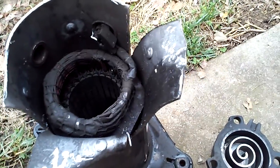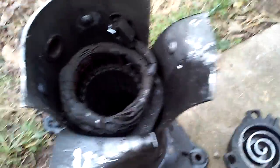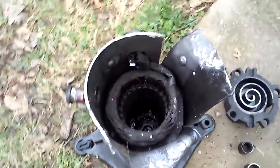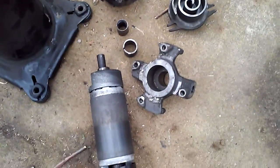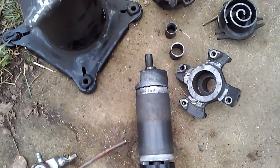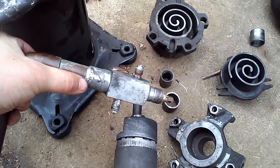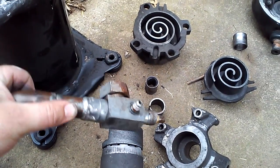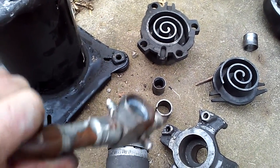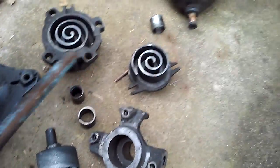Then I had to go back and put a new compressor in. You need to use 45% minimum silver solder between copper and steel here — 45% silver.